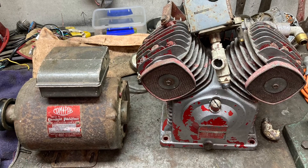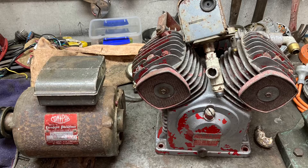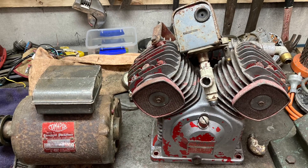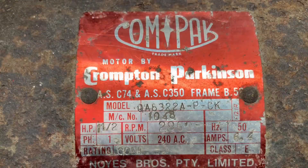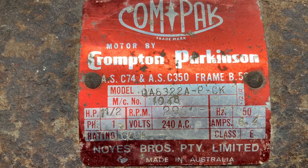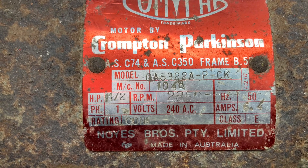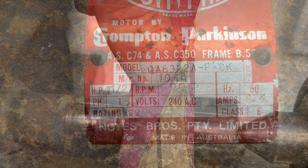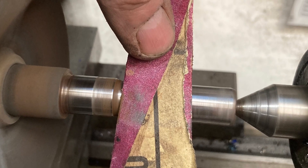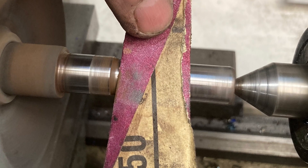Up on the bench now, I've got three of the four main components of your compressor: the electric motor on the left, the pump on the right, and sitting on top of the pump is the cutoff switch and unloader valve. The electric motor was made in Australia by Crompton Parkinson for Compact compressors. I was originally going to scrap it, but once I cleaned it up I realized it just needed two new bearings, which I happened to have. So I cleaned up the rotor on the lathe, put the motor back together again, and it worked beautifully — smooth and quiet.